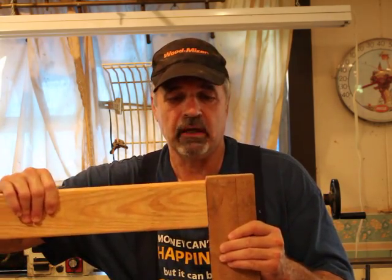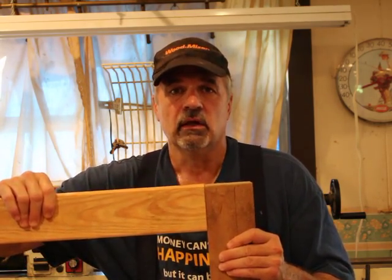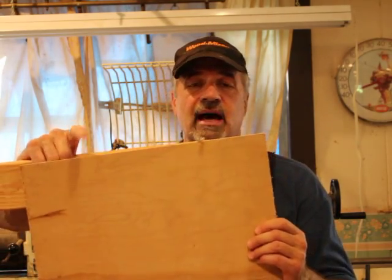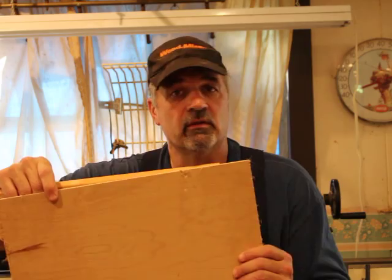What I'll do is I have a vertical running 2x4 this way. I'm going to butt joint a horizontal 2x4, and then we'll lay a skin of T111 over the top of that. These doors have worked well for me. They're very stable. They don't sag. So I'm looking forward to getting started on this project.